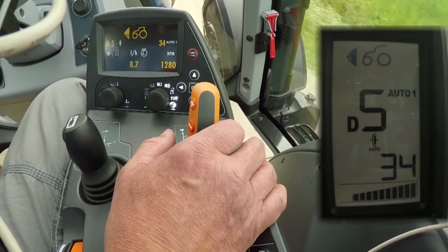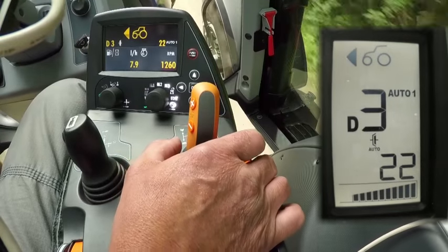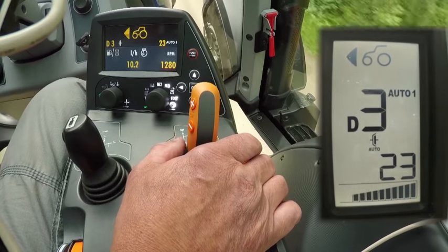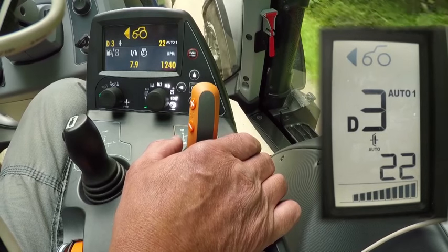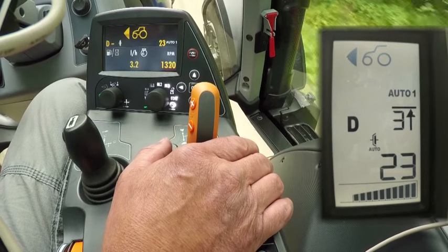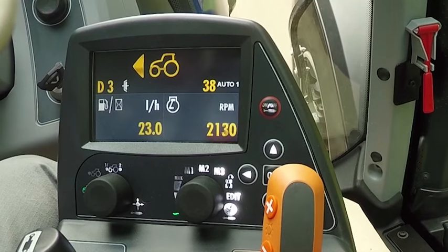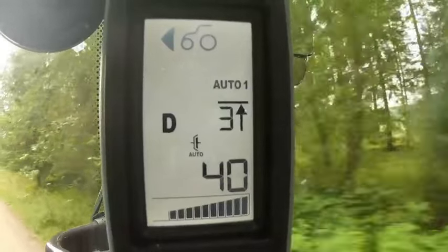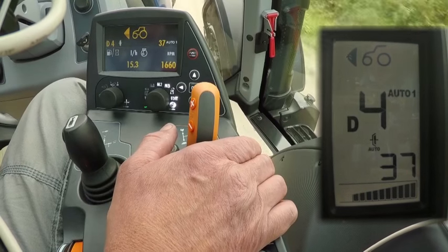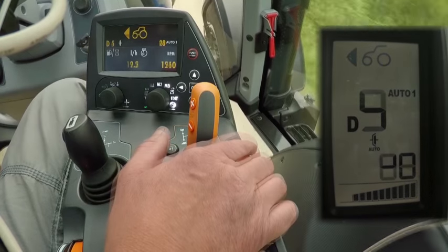In a field situation doing haulage work, there often comes a time when the tractor is constantly changing from C3 up to C4, which is then too high a gear, so it automatically changes back down again. We can prevent these changes by pressing the powershift limit button next to the gear lever. Here we're driving in D3. If you don't want the tractor to go up to D4 or D5, simply press the powershift limit button. In the A pillar display there is a number 3 and an arrow underneath the auto 1 symbol. Now we can get more revs with the accelerator but the tractor is not changing to a higher gear — we have 2000 rpm but the powershift gear stays in third. When we deactivate the limiter by pressing the same button again, the automatics immediately change the powershift gear up to five and the engine revs drop, making it more economical to drive. This feature is really good especially when working in the field.